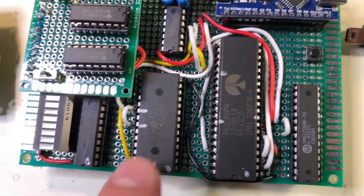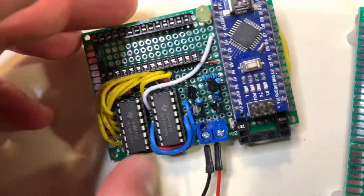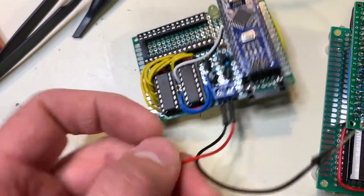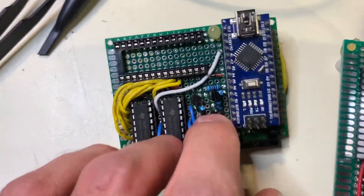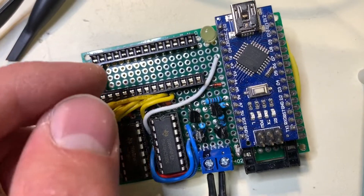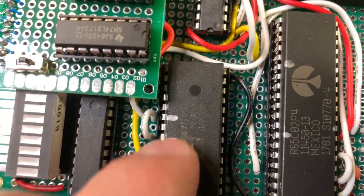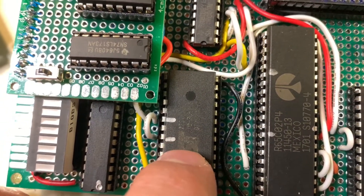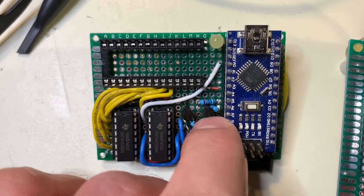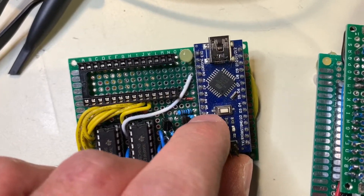It has an SST flash chip, which I made a programmer for here, which uses multiple voltage levels for control. It uses a 12-volt input here, which is gated through these transistors here. This is what allows the Arduino to control the write and clear operations, because this particular chip needs 12 volts applied to certain pins in order to erase it and write data to it. There's a gating system in here to allow the Arduino to control the 12-volt signal while also not letting it back-feed onto the tri-state buffers of the Arduino.